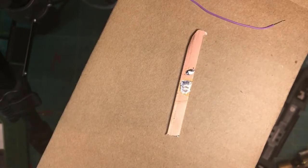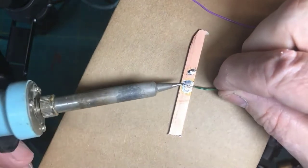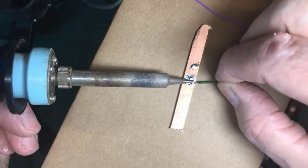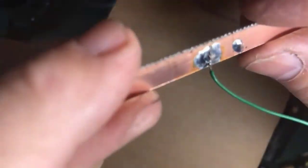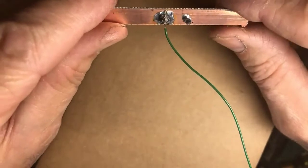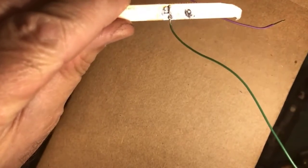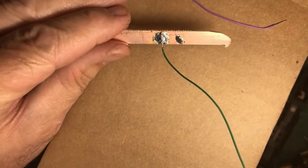Now that I have the thing prepared, I take my tinned wire, and this goes to the other gentleman's comment about tinning the wire. Tinning the wire in this case means that with the wire tinned and with the pad or area where I want to apply it, I can just, and again, we're looking for a nice place where the solder is flowed up onto the thing we attached. Now, does that help you, Ken, in terms of trying to put a wire onto a pad?